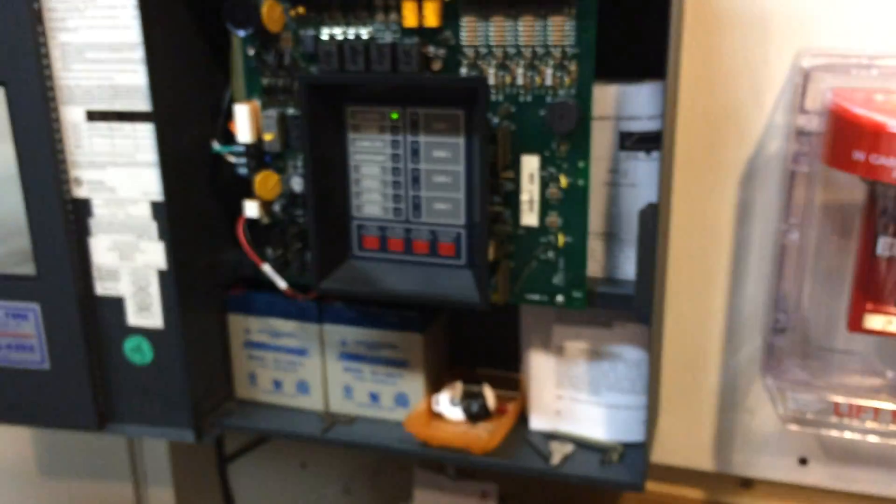So you know when I pull the fire alarm, it gives a little bit of delay. That's because I have switch number one down here turned on — the DIP switch. Number one is on, and that means it has about four seconds of verification.